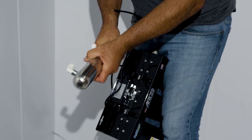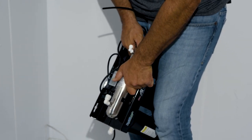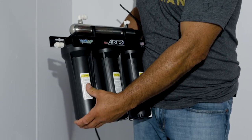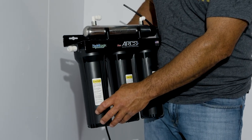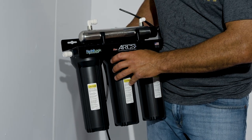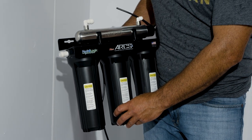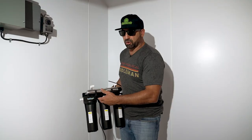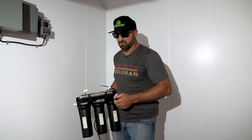The unit threads right back on there nice and snug. It takes the condensate water we're collecting in a reservoir, runs it into a booster pump which pressurizes the water, then it goes through a sediment filter — removing all the gunk, sand, and debris — and then into a metal filter designed for removing heavy metals: lead, ferrous metals, iron, aluminum, and copper.